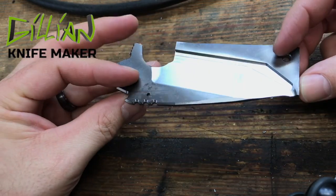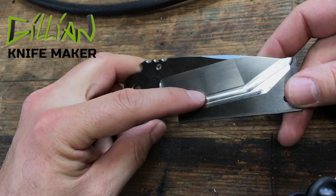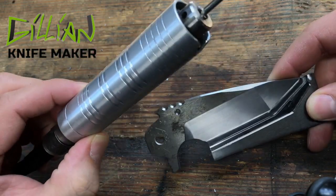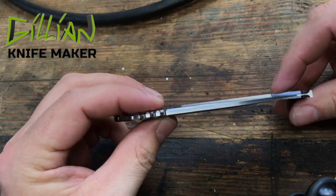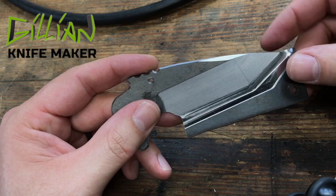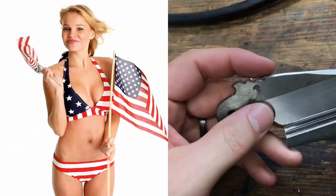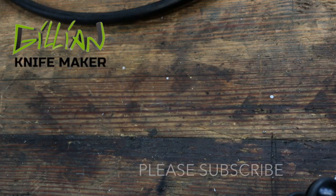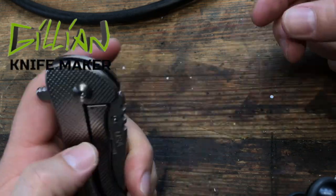Here's my blade blank — machined with bevels on both sides. The next process is removing the step-overs using a tool called the Foredom, a jewelry-making tool I use all the time for knives. I also need to surface grind to final thickness, cut the excess metal free, and engrave my name, the blade steel type, and USA — because I love this country. We're coming up on 15 minutes so I'll end the video here. Thank you for watching — my name is Christopher Gillen and I look forward to seeing you in the next video.